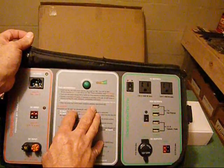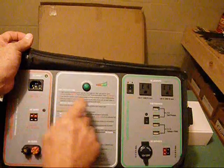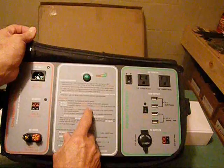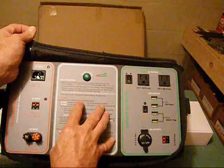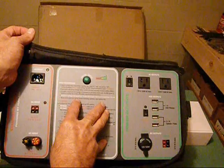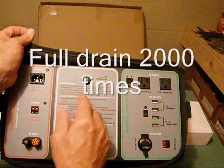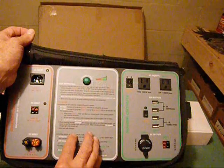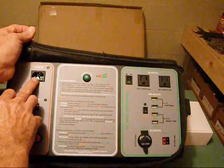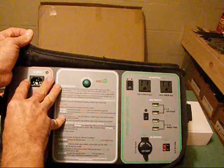What's great about the storage is it can take a charge. You can charge it with your AC input, and it'll hold a charge for a year with only a 3% loss. That's a really good charge. It's a 2,000 life cycle battery, meaning you can charge it and use it 2,000 times. As for the input, with the AC input, while the power grid is up, you charge this and you've got a good charge for a year.